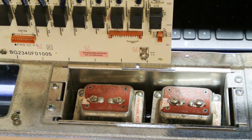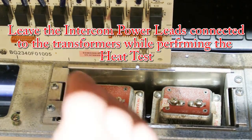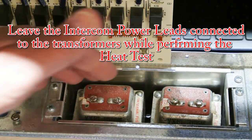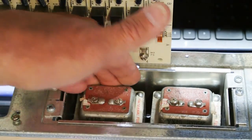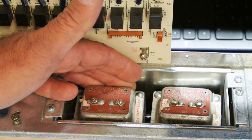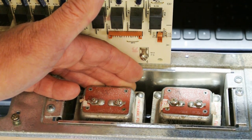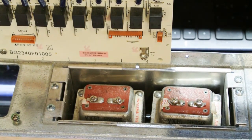There are three tests you can do if you suspect a transformer problem. The first is the heat test. Once you've opened your master station, carefully reach inside and put your fingers on the metal body of the transformer to feel how hot it is. A normally operating transformer will be very slightly warm to the touch — like holding something slightly warm on a cool fall morning, comfortable but not hot. If your transformers are warm to the touch, it's a good indication they may be working correctly and your problem lies elsewhere.